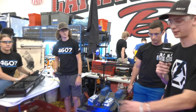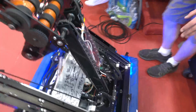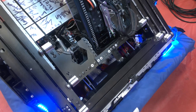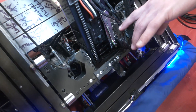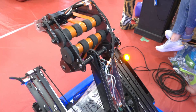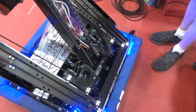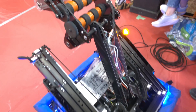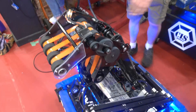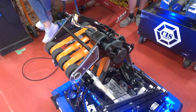Talking about the arm itself and the manipulator — on our arm we have a 90-degree gearbox with a 75-to-1 gear reduction. We have a shaft that connects the gearbox to our carriage stage, and a full-size Neo directly drives that shaft to allow us to move up and down. We also have what we call a virtual four-bar, which is this chain right here, and that keeps the angle of our manipulator the exact same whether we're doing shelf pickup or ground pickup of cones or cubes.